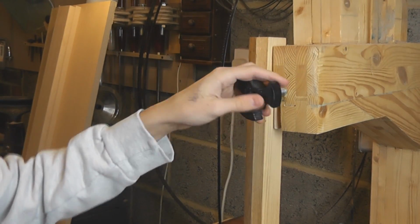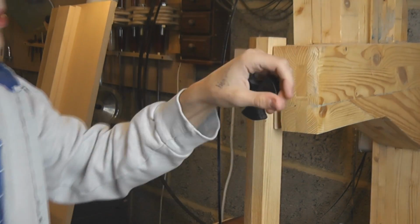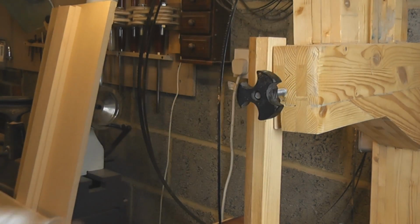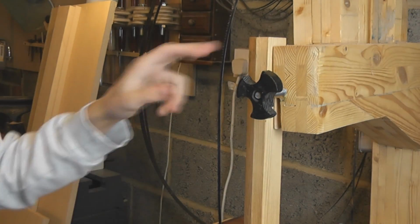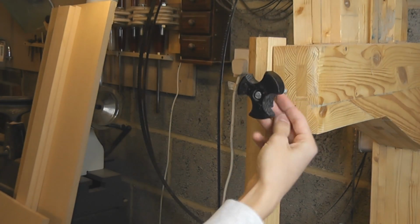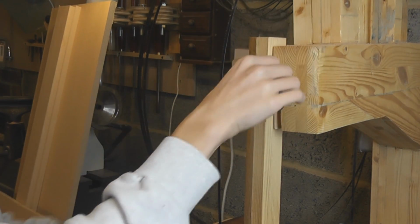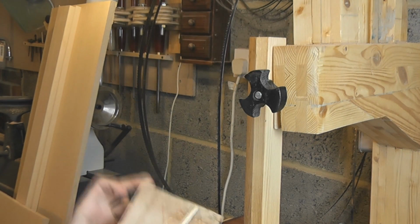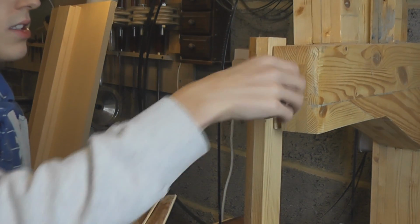So I suppose that's something nice about having built the bandsaw, that way I can fix any problems which arise, because I built it from scratch. But I'm kind of surprised it went, actually. Usually epoxy holds really well. I also expected that the mechanical tooth of the threaded rod would hold it in really well, but perhaps there wasn't enough epoxy in there, or it's just the fact it's cheapo epoxy, which really is not going to be a heavy duty solution. So see how long that lasts.